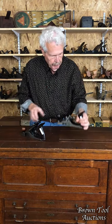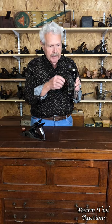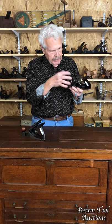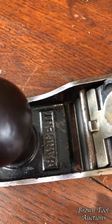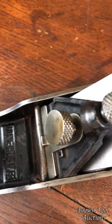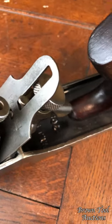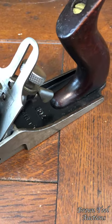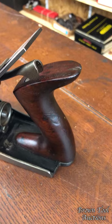And this one here is an example of Albert Page's patent auto set, which is an alternative method of setting the depth of the cutter in the cutter holder, what's called the frog. The other tool companies were always fiddling around trying to improve on the basic design and come up with different ways to adjust the cutter depth. And really nobody ever came up with one that was any better than the Leonard Bailey design, which is why none of these really caught on far.